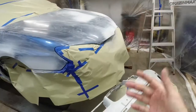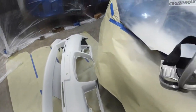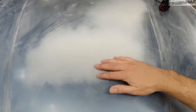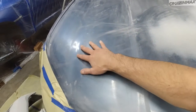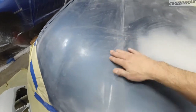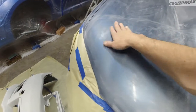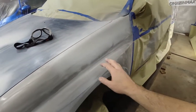I'll show you the result when I'm done. It's still dusty. What you want to do is use one hand to sand and the other to feel out the roughness. I just found I need to do a little bit more here because this part is smoother than this part. I'm gonna blow this off with compressed air and go over it again — sandpaper saved the day, hopefully.